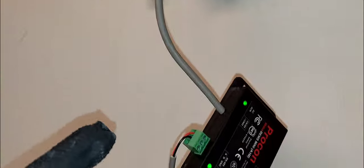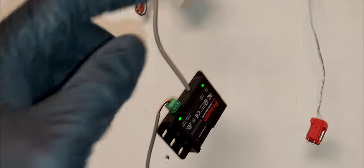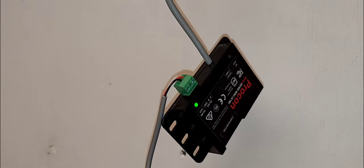The BMS wires are currently disconnected because I didn't want to interfere with the building BMS or BAS system communication. You've got to be careful not to touch these or short them together, because you might knock the entire BAS system offline temporarily.